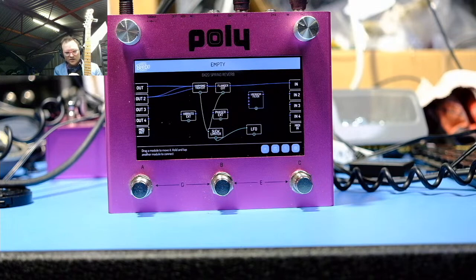Since I did the original design of these, the MIDI Manufacturers Association announced a standard for MIDI on TRS, and that standard is 3.5mm. It supports this 3.5mm one, so these are actually standard connectors nowadays. But the pinout is the opposite way around from what I chose. I chose the same one as Chase Bliss because that was common, but Type A is now the standard one. So the future ones, I will be switching the hardware when I do new circuit boards. They'll be switching to Type A eventually. Obviously, it won't really change anything for anybody. I just want to use the standard plugs now that there is a standard. They're the same connectors and everything.